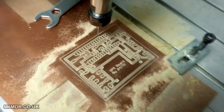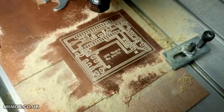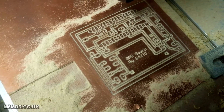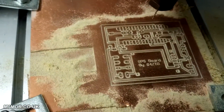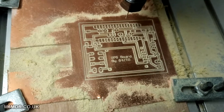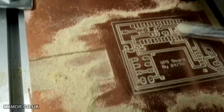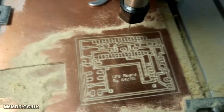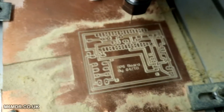I sent my friend away the other day with a board based on the wrong steps — I wasn't observant enough to notice the board was too small. So this is the replacement for it. Nice isolation, good track thickness. The pads are a bit small — you have to use such a small drill bit they end up milling themselves away or shearing off sometimes. So what we've had to do is test some of the parts and give them these big oval pads, so you've got plenty of room for the pin to come through and a good area to solder to. And that seems to work well.